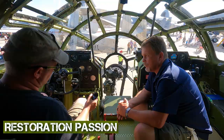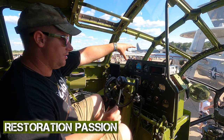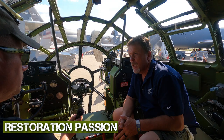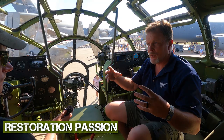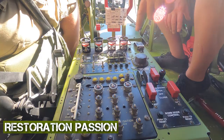Again, referring to the bombers we know a little better, it's the first aircraft where you don't have that forward nose section. The guy's literally right there. We can talk some about that, because that question comes up a lot. Why is this airplane shaped the way it is? It almost looks like a submarine, doesn't it? This being the first pressurized bomber, how do you best contain pressure? In a cylinder. That's why the nose of this airplane is shaped the way it is. And you've got your autopilot controls from back in the day. Now we don't have that going on today. And everything else is as you see it labeled.